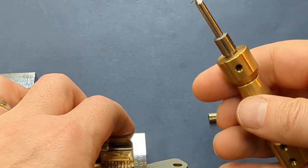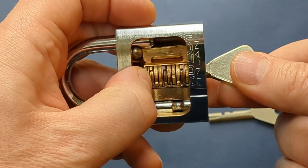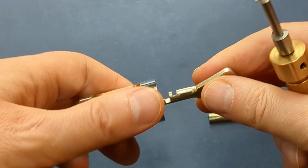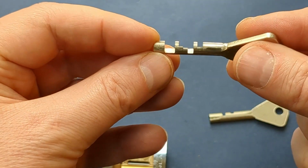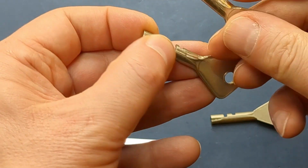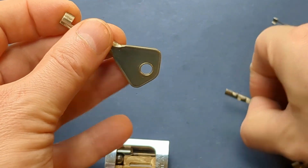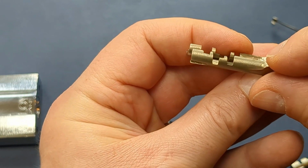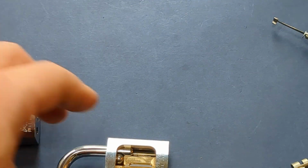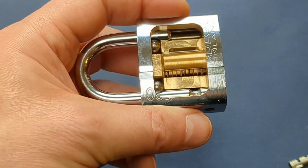Something that you may have noticed, in this lock there's two of the final discs that are actually max rotation, and that is actually quite common. You can see there, that's the chunk of key, and similarly that one, same, this one, same. So for most locks, you could actually do a tensioner that would do two discs.